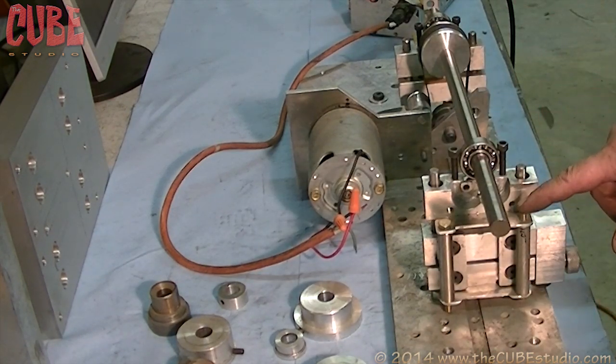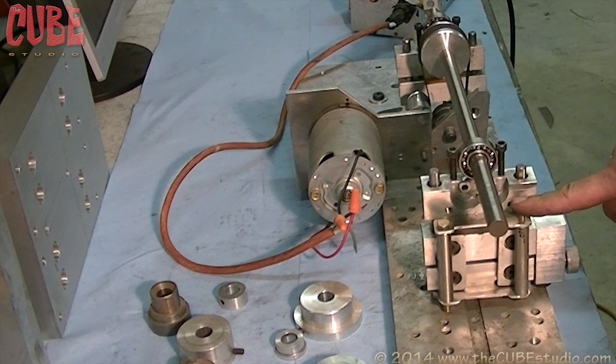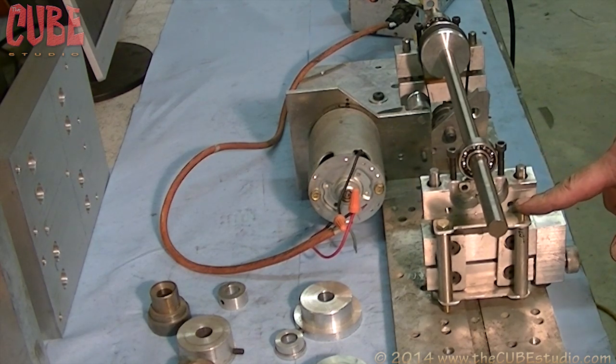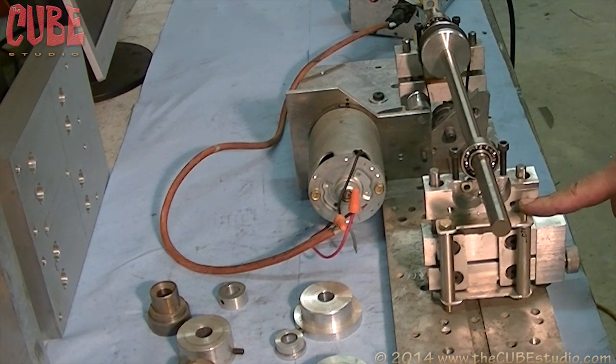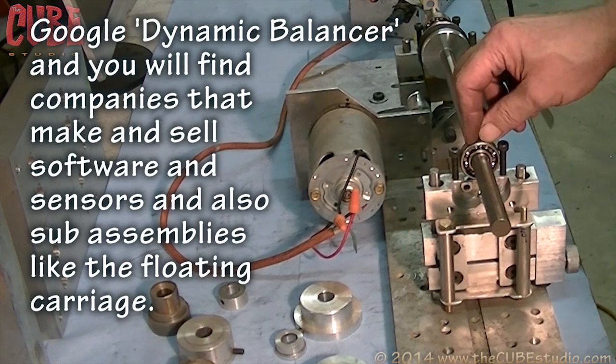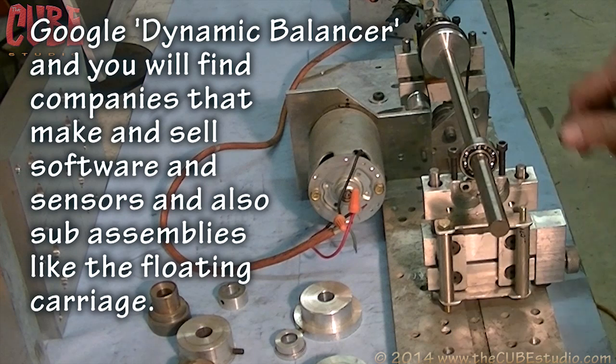What you need basically is what's called a floating carriage. You can see it's on ball bearings, it's suspended, and that shaft is free to move back and forth. Now, it's contained, it can't move very far, but of course you don't want it to. These screws are to keep that bearing where it belongs. There's also a different set of bearings in here for larger items.